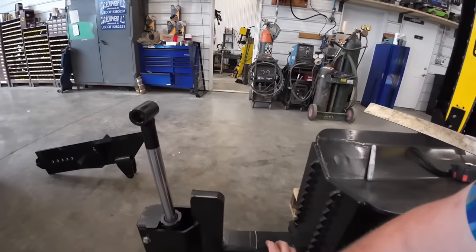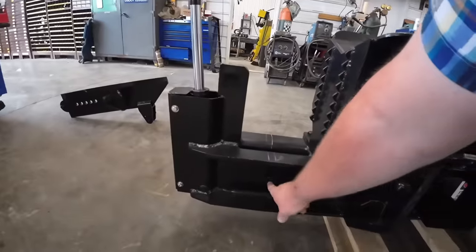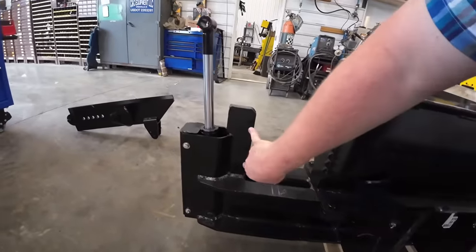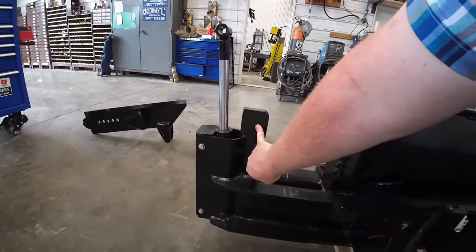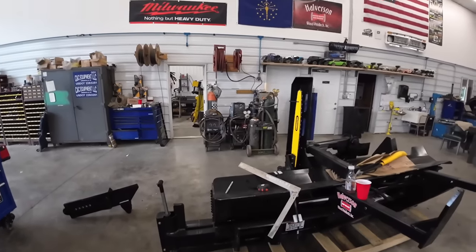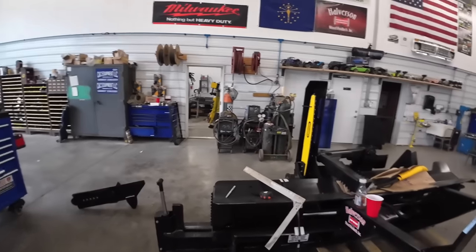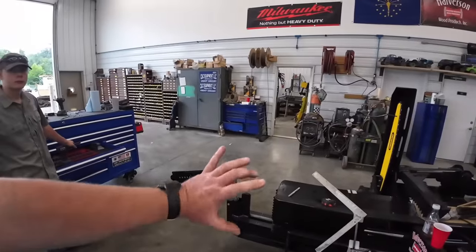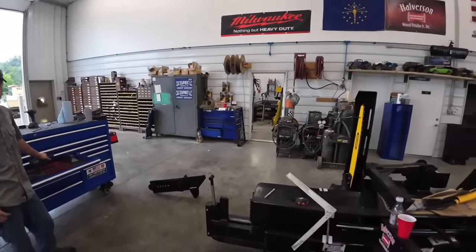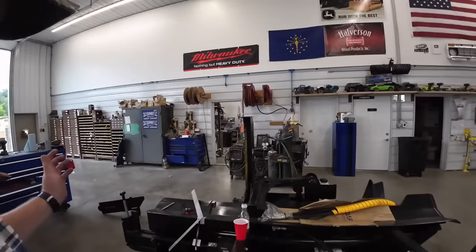So this is about a 3/4 inch wide slot, so we're going to cut some 3/4 inch steel. We're going to fasten it with a 1-inch bolt here, and I think we may drill a couple holes through here to fasten that too, because we want something pretty solid that doesn't move. So the lumber, the white oak they're cutting is very expensive wood, so he doesn't want to waste it. That being said, this whole machine should be able to go back to original configuration. So for some reason if they don't do that somewhere, we can go back and cut wood.